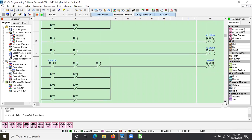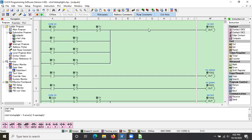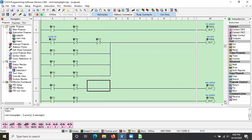This will run you a normal stoplight. It's the most systematic way I can explain it — it's not the easiest, and there are certainly some shortcuts. For example, if you know you're on for cycle one through cycle four, you can probably rearrange this logic to make it a little simpler to keep it on for those four timers. But this way tells me it's on for timer one, two, three, and four — so if I'm troubleshooting, this might be a little easier.